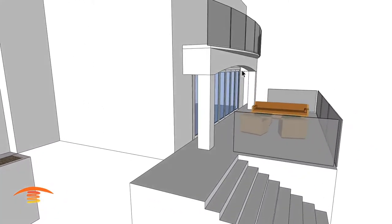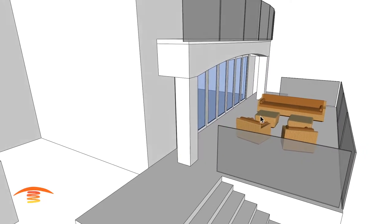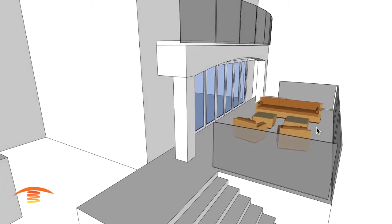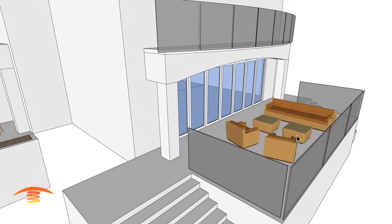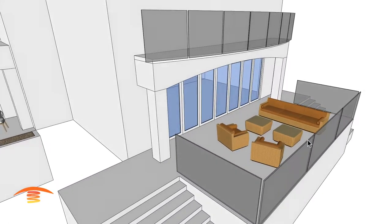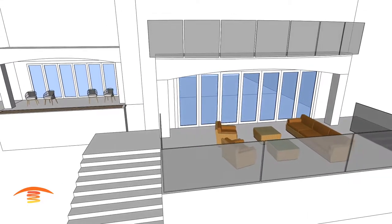This is a far throw for a heater off this edge, so out here will not be as warm as it will be close to the heater. You're really pushing and throwing the heat as far as you possibly can, which will be okay, but it's not going to be ideal for the outer edge of the seating area. You may have to rearrange seating based on your function.